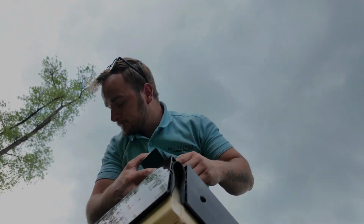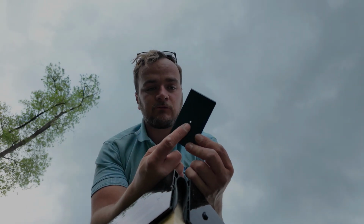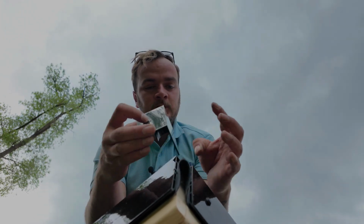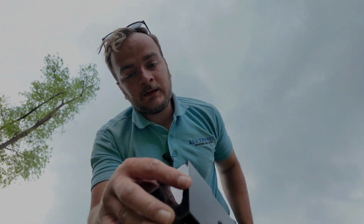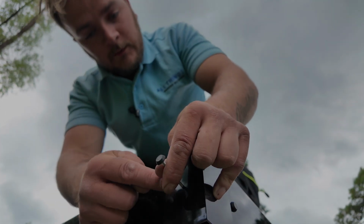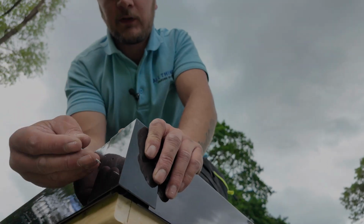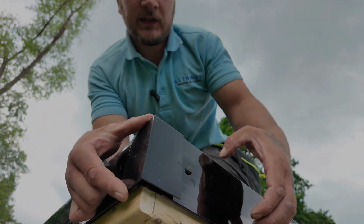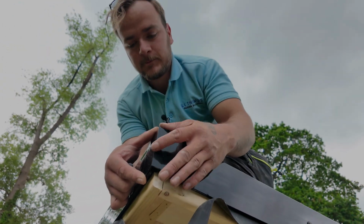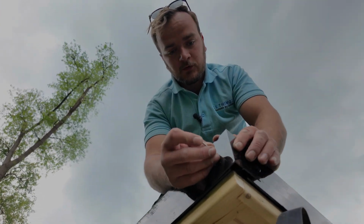And what I have done as well, you can glue these with mitre adhesive, but what I prefer to do, drill a hole through, because these can be brittle, especially in winter. Drill a hole through. What that allows me to do, put a polytop nail through here, into the timber behind. But you'll only do one side, because what you need is for, if this needs to expand, it can come this way, in and out, inside this trim. You can't see it. And this can do the same. So I'm going to get these nailed on, and then we'll jump onto the joining trims.